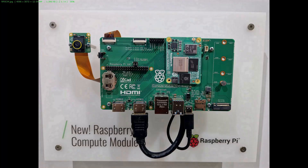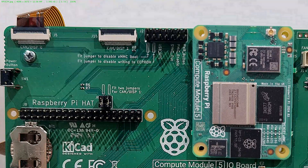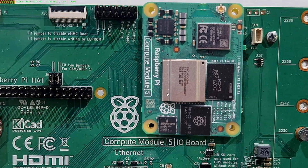This is a really great module. Let's go around this board and see what else it's got. We have this 14-pin header. Here is probably a connector for an external button. This is PMIC enabled — PMIC is data that you can gain from the power management controller. You can see all the voltages and amperages from this controller using the VCGEN command. This command is really powerful and gives you a lot of information. You can watch that video if you want to learn more about it.